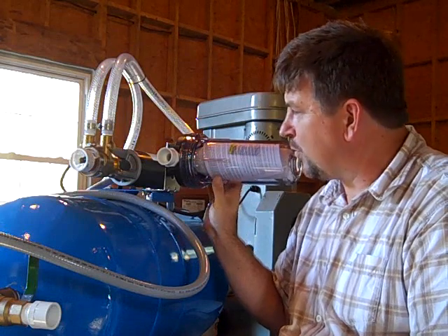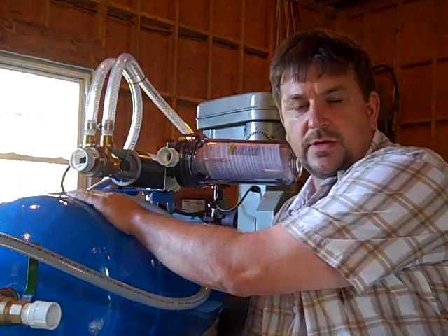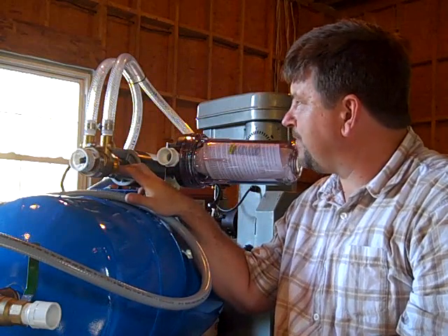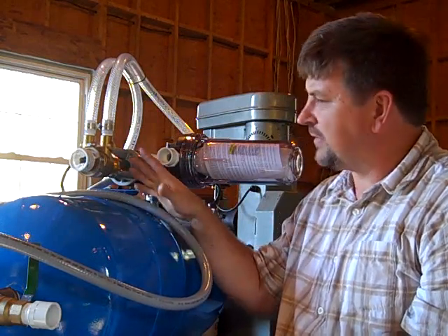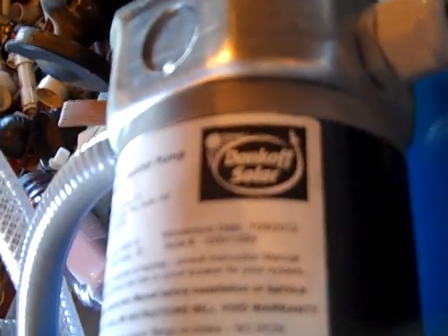The key to that is inline filtering before the water enters the brass head. What I've got set up here — I know it looks like a contraption — but I've done four of these now, just mounting the booster like you would on a jet pump tank, and then powering this off of either 12, 24, or 48 volt battery banks. For the most part we're doing little 12 volt batteries, running this 12 volt pump at 25 amps.